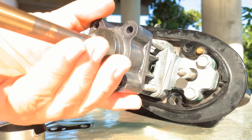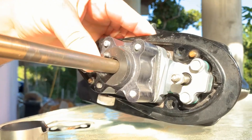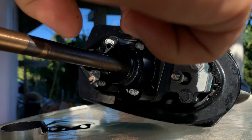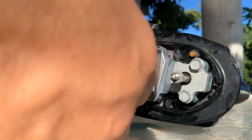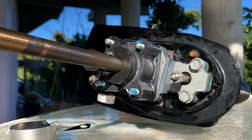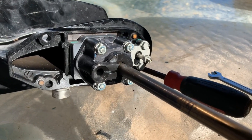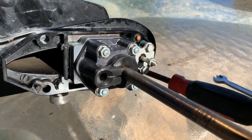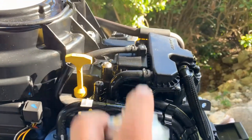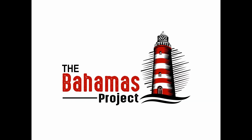This is the key element: once the impeller is on and you put the casing back on, you have to turn the shaft clockwise to bend the rubber paddles in the correct sense. Once that's on, I put a little bit of marine grease on there to help get the thing off in future. I'll religiously check the impeller every month and probably change it every two to three months - it's only about 30 dollars for the kit, so it's well worth it to avoid failures at sea. I also bought some lacquer to protect the engine and gave it a spray to keep it looking as good as possible.